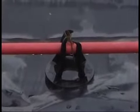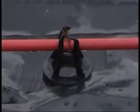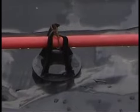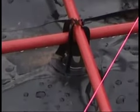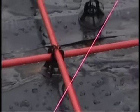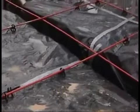Residential and commercial slab and grade construction requires plastic chairs at the intersections of the tendons. These chairs support the tendons so that they are surrounded by concrete. The cable will still compress the concrete without concrete around it. However, unchaired tendons are exposed to moisture, and that can cause premature oxidation. Besides, the architect wants to make sure they have adequate support, and our job is to help our clients enforce the architect's design.